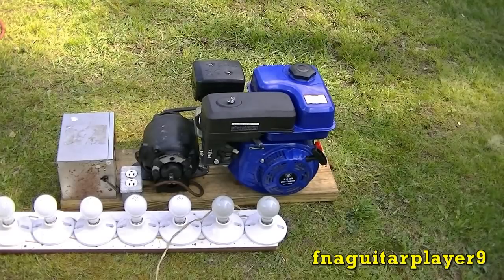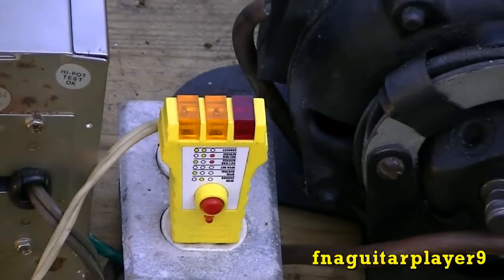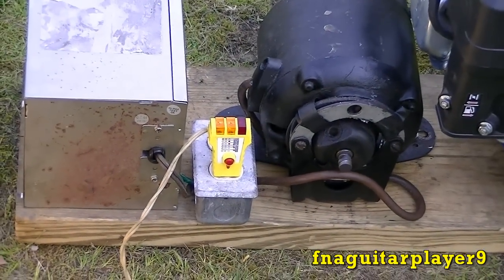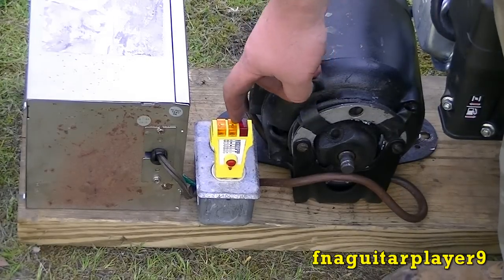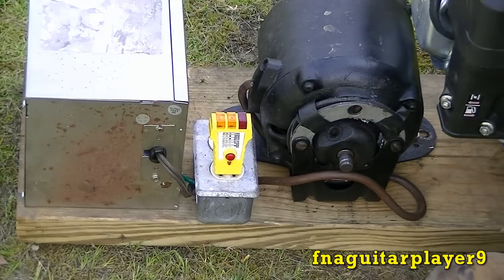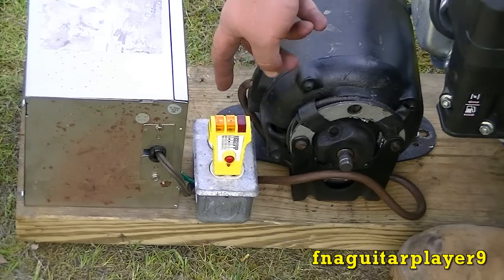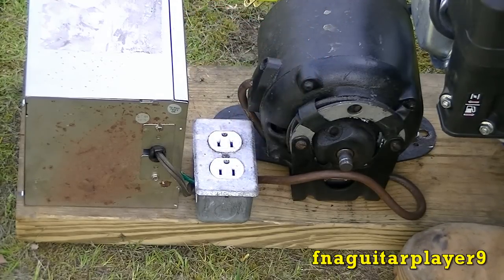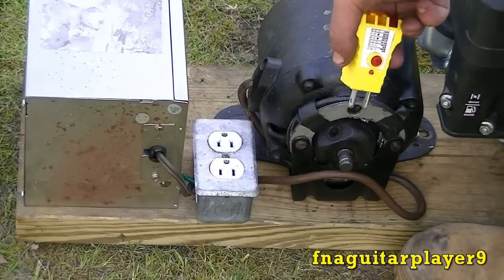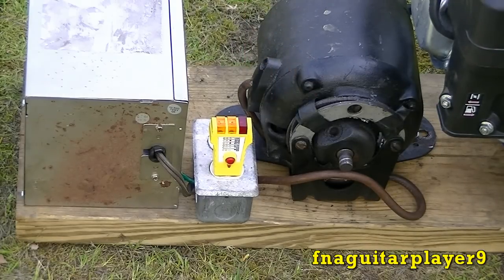This engine is a little overkill — you don't need nowhere near six and a half horsepower. It's always important to test your polarity on a generator like this, to make sure your hot and neutral are not reversed. Now the middle light was on; if you plug it into an outlet that's wired correctly, both yellow lights will come on. If you ever get the red light, you've got something wrong. The reason it's reading an open ground is because it's not tied into anything — I didn't tie it into the neutral, which you probably should. That way if you ever get a short and a wire came loose in the box, it would short out against the frame.